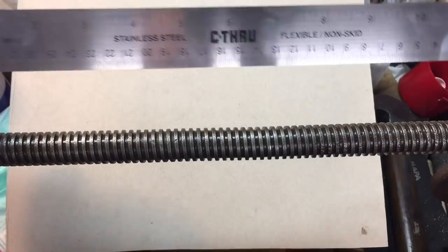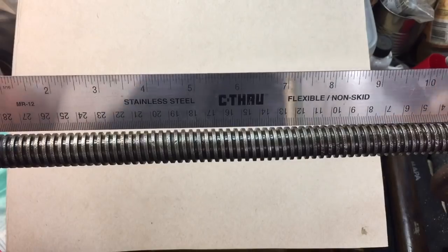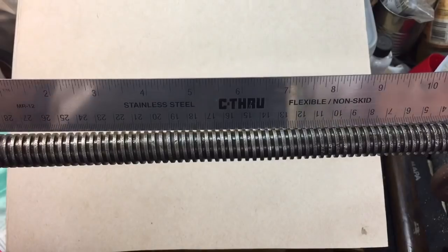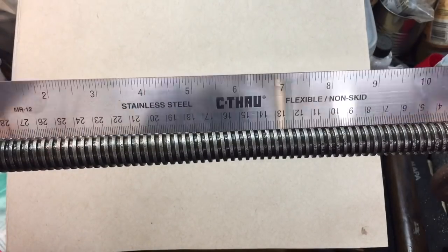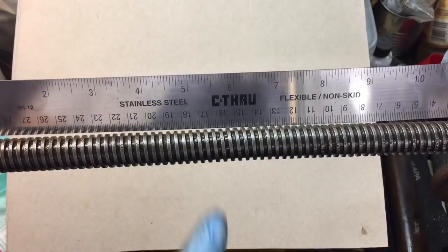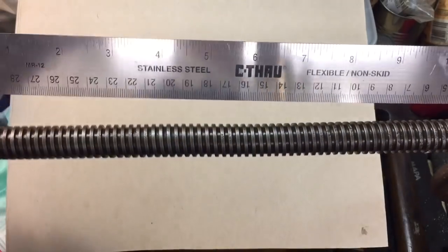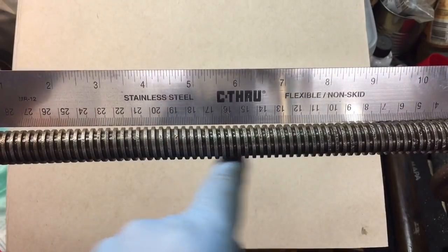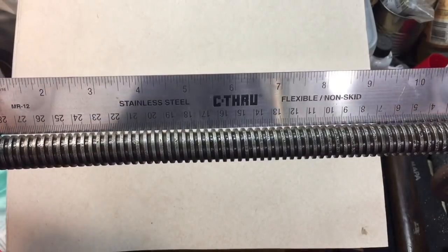We're starting to get close. We take it back, put something light behind the threads, and rest the straight edge on here to see what's happening. We've got a high spot here towards the right, and when we turn it a little bit we can see where we are. This side's not too bad, but we've got a little dip here, so we've got to put some pressure there. You've got to keep chasing it back and forth, looking for the high spots and the low spots, then taking it back to the dake and straightening it out.